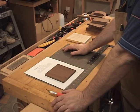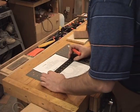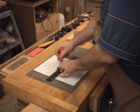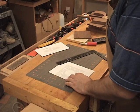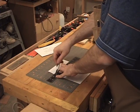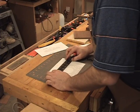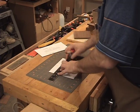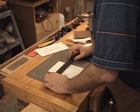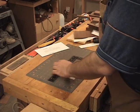When I have a piece of wood that's going to exactly match the pattern, I take a straight edge and an exacto knife and cut the pattern out to the exact dimensions before I apply it to the wood — it makes everything a little bit easier. Then we'll use our standard technique of applying the pattern with spray adhesive and cover the pattern with clear adhesive box tape. The box tape helps lubricate the blade and keep it from burning the wood.